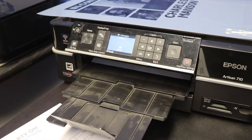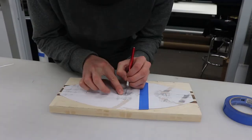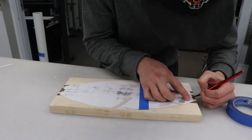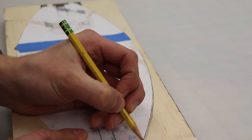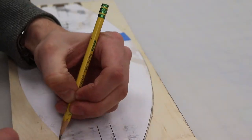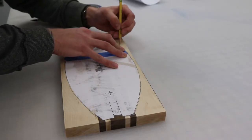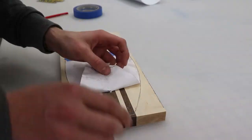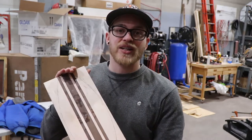The pattern I created in Adobe Illustrator — I put a link down in the description to my Instagram and you can DM me to get the pattern for free. Take some spray adhesive and spray it onto the paper, then apply the paper to the board. I use an exacto knife to cut into the pattern so I knew where to drill later. Trace the pattern with a pencil, then remove the pattern from the board. You don't have to be the best artist — you just need to roughly sketch the outline, the stencil.